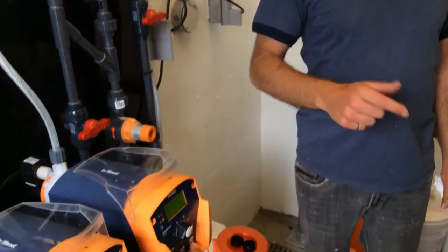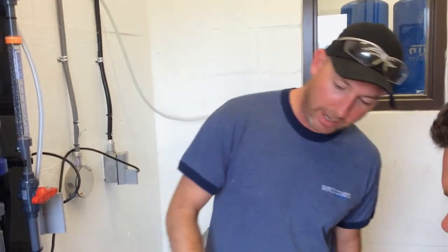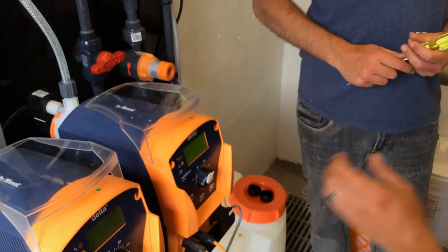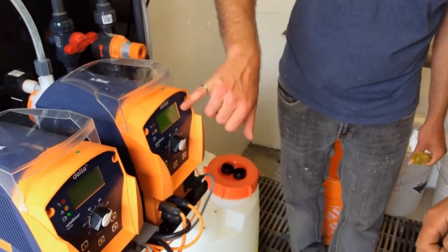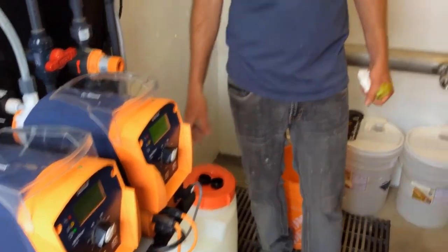I'm going to tell you a problem with periodic, but I don't want to time out just yet. So if we go to airlock, press P. D time is degassing time. That's how long I run at full speed repriming myself. I've got it set at 40 seconds. Maybe you want it less, maybe you want it more, depending on what happens. So you might change that number.